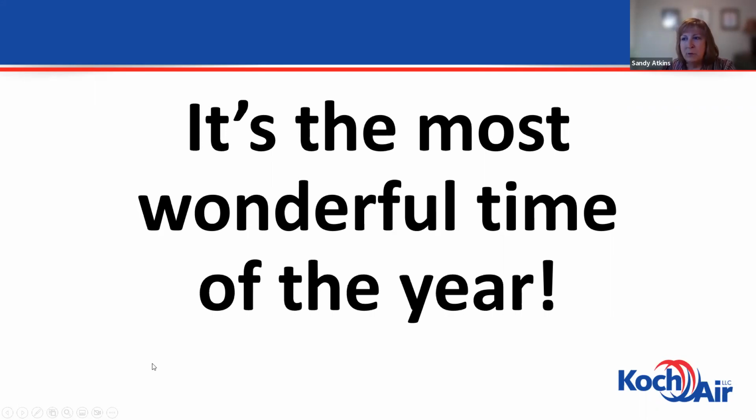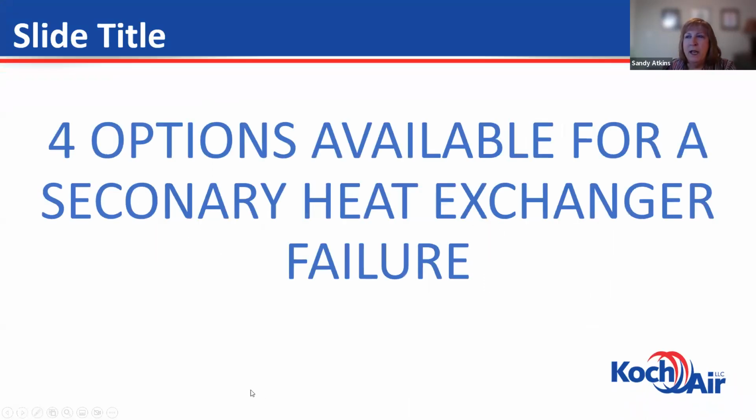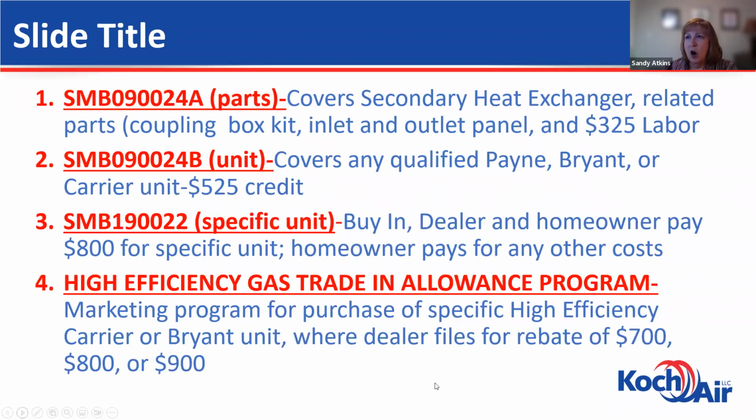But it's more like, okay, if you go to look at a customer's unit and it meets the criteria, what criteria does it match? So the first thing that we know is that there's 4 options available when we come across a secondary heat exchanger that fails. And our options are, the first one, this is the old bulletin that came out in 2009